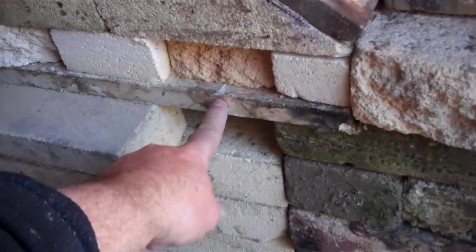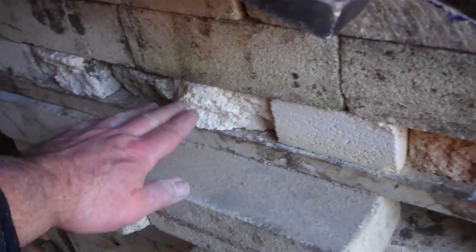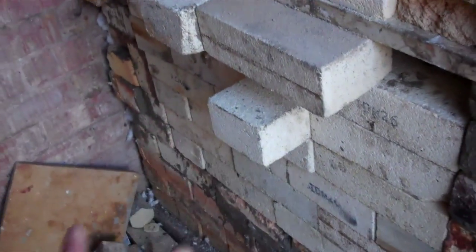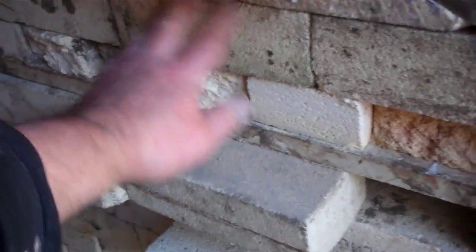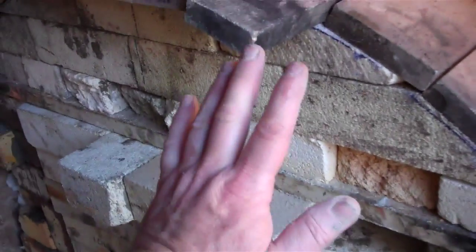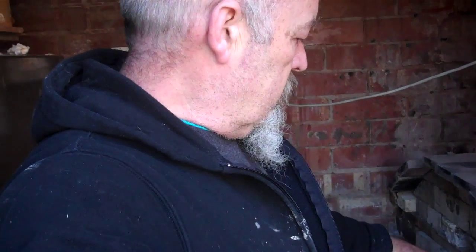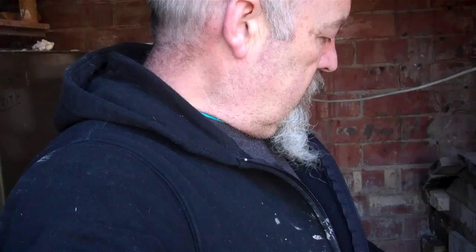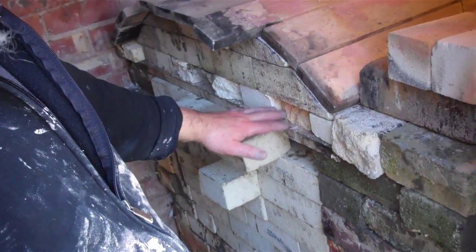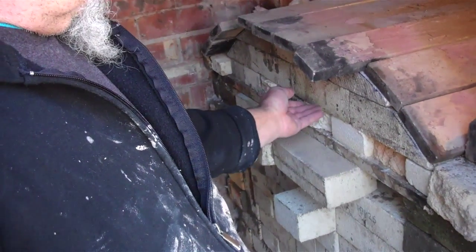And there's the door. The only thing I'm going to change is this lintel here — I'm going to bring it up to this level here, so that brick will go there. These will become part of the door, top of the door. The lintel will go up and that will give me more access through the door to get into packing this area inside the kiln. That's the only drawback with this kind of design — you can't get access at the top and have to sort of shuffle through. I've managed to get the bricks wedged in here; they've got to be finessed. When you put bricks and shelves in, everything compresses and these need fine tuning. That's why I'm going to use these half bricks at the top — they'll be chamfered down and will be my filler bricks at the top of the door. That lintel layer will come up to under this course of bricks here.